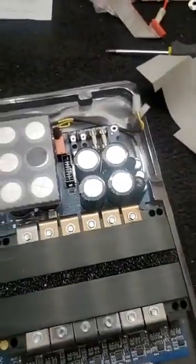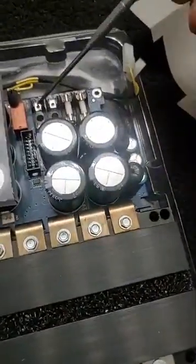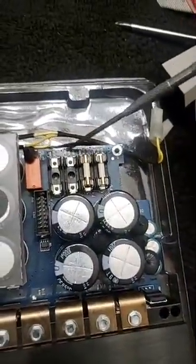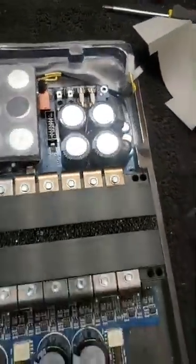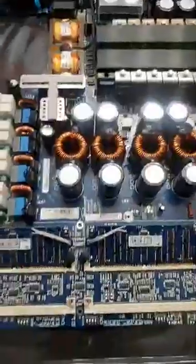As you can probably see, over here it had taken out two fuses — channel one and channel two. These are the fuses that control or provide power to that circuitry, so those were knocked out. I knew that basically you have some damage on the board. Those fuses don't blow unless something is shorted out, like one of the semiconductor components or whatever.